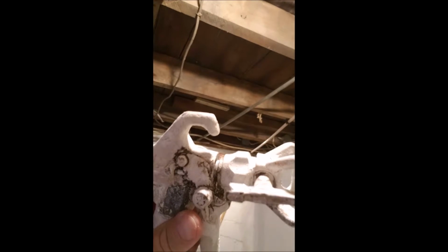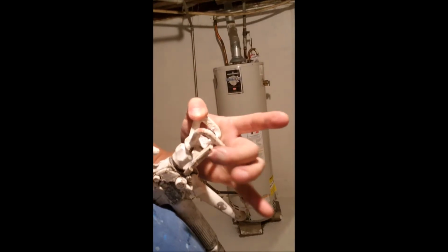When the tip clogs up on this sprayer, basically, here's the sprayer. This side, there's a tip on it right here. This is a tip. It comes out. When that clogs up, you got to reverse the tip, spin it backwards, and blow pressure through it the opposite way to clean the tip. Hopefully we don't have a lot of that today with the new line. It can really make your job a pain in the butt when that happens. You're trying to spray and it's constantly clogging up. Usually it's the filter, or you've used a dirty bucket or something like that and it keeps sucking little bits of dirt of some sort through.